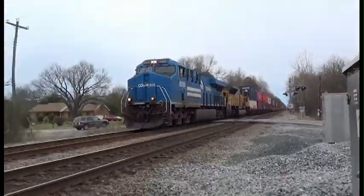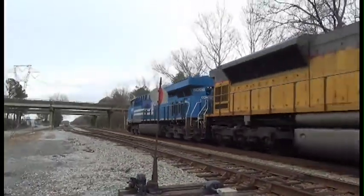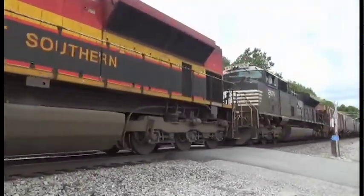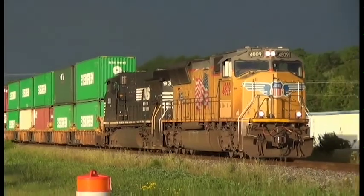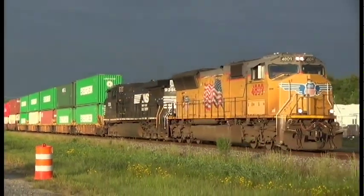Power is created by a medium-speed diesel engine of varying horsepower and is used to drive either a generator or alternator. The electricity is then sent to either 4 or 6 AC or DC traction motors to rotate the axles. These motor and axle sets are mounted in pairs of 2 or 3 in assemblies called trucks, which both aid in transmission of power and provide a smoother ride than rigid axles.